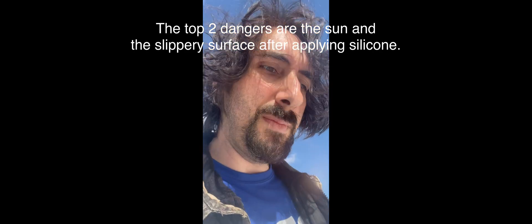Today was actually the day some roofers were supposed to come up and put acrylic roofing on, but I decided to do the job myself and show all of you, since this is within my skill range. The first step is to check the weather to make sure it's a sunny day. The second step is to power wash the roof — I had some guys power wash it for me since they had a large gas power washer specifically for cleaning roofs quickly, and it came out very clean.